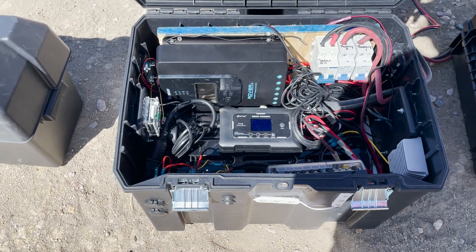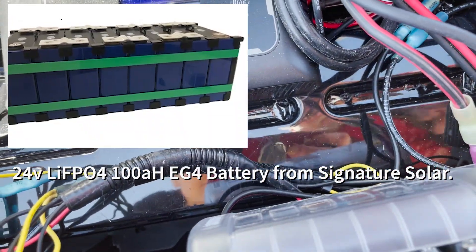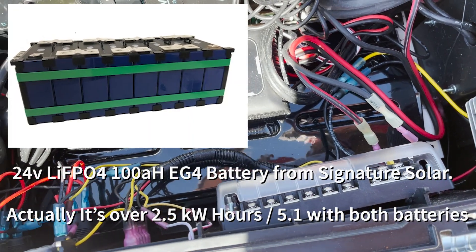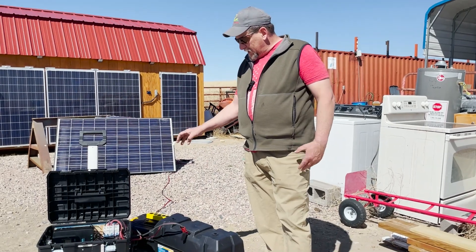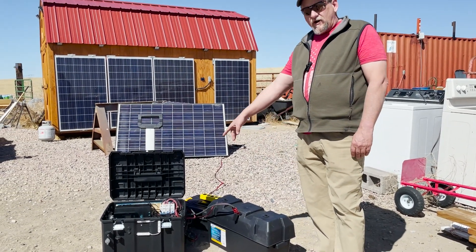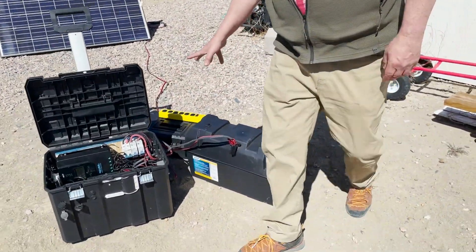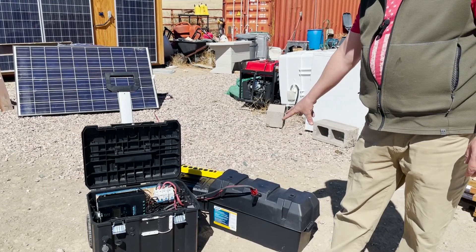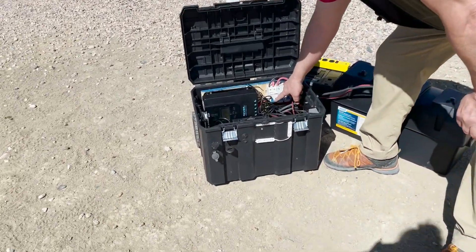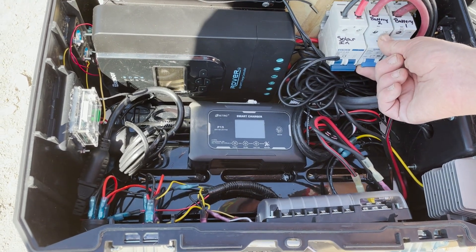Down here is the heart of the unit — a lithium iron phosphate battery, 24 volt, 2.4 kilowatt-hour. Because the batteries are so heavy, I made the system modular. Two batteries in one box wouldn't fit and would weigh over 100 pounds, so the second battery is a modular unit that connects with Anderson plugs. Right now I'm going to power the system with the second battery to charge it up. I'll flip the breaker — solar off, battery one off — and flip on battery two, the auxiliary battery.